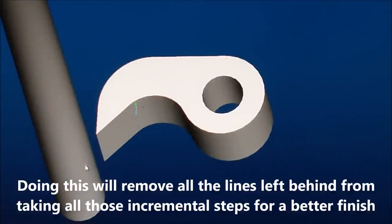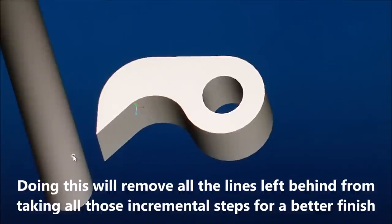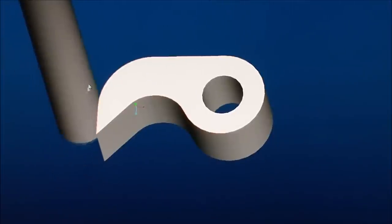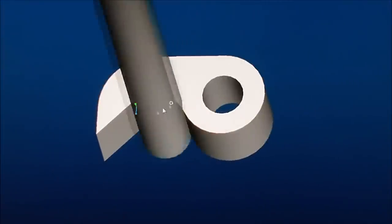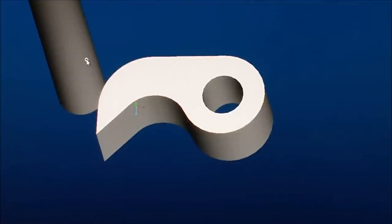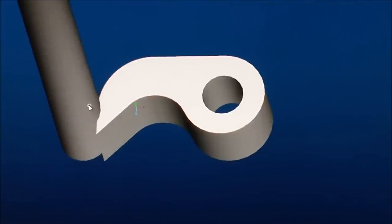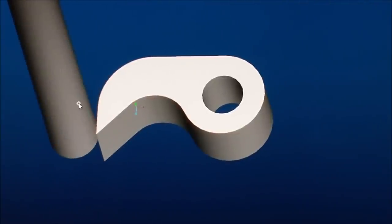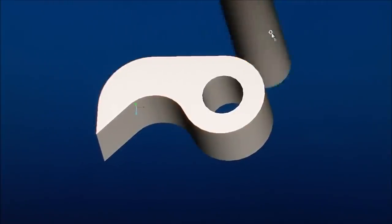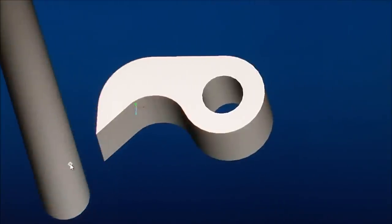So you're going to see the cutter dancing around a little bit down here in this corner. The initial placement is going to be down here. It'll slide over. It'll start to cut this way around the perimeter and jump off, reposition, and start again. Well, it's not going to be into the part like that, of course. I'm doing this freehand. So it will be tangent to the edge. It'll be comp left, and it'll be climb cutting the entire perimeter. 0.75 end mill, 2 flute.